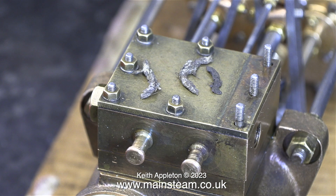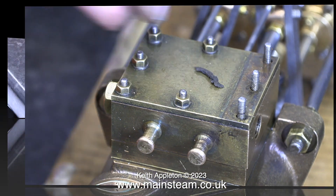On the top of the steam chest is the remains of the graphite yarn that I pulled out of the glands. This is not a good idea — it's far too thick. If you're going to fit graphite yarn in addition to o-rings, make sure it's very thin stuff so you can wind it around the piston and gland rods to seal them.